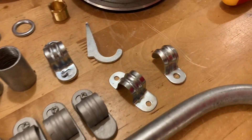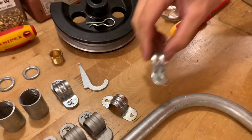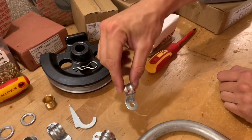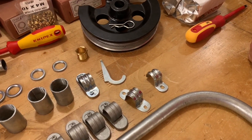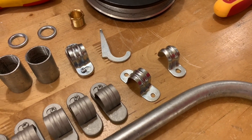This next one is a bit unusual — that's a one-hole plane saddle. We might use that in locations where the conduit is going to be plasterboarded over and not going to be seen. It's a quick fixing for the electrician but obviously there's no access once it's installed.